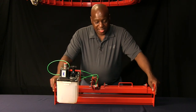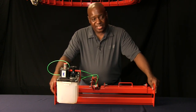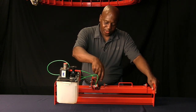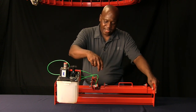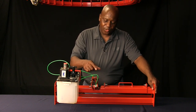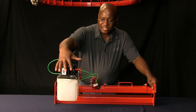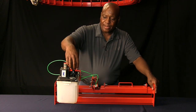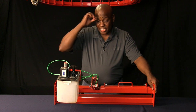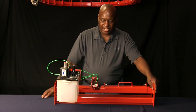This unit here is the lubrication system on the power and free system — this can be a power-only or power and free section, but it's predominantly for oiling the chain in the system. The front one oils the blocks, and there's an oil port at the top of the blocks that pushes oil through onto the pins. The two side ones facilitate oiling through the bearings at the side. The unit is pumped with oil from this bottle here, which can be primed initially and adjusted by this plunger at the top of the bottle. The unit is either 120 or 240 volt powered and pipes through as a single unit, splitting into three areas at the back end.